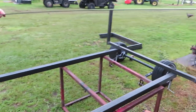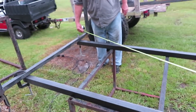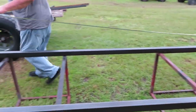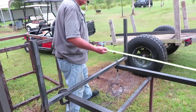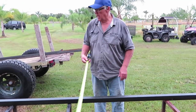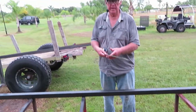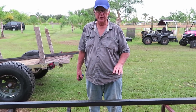It's a little hard to do this by yourself, but you've got to go corner to corner and measure the inches diagonally from this side to that side to make sure it's square. If it's not square, don't weld it. Next, I take a level and tuck it to this beam, the beam over here, and the two cross beams to make sure they're level, because this is very critical on this weld. If you don't have it level, your trailer's going to be crooked.